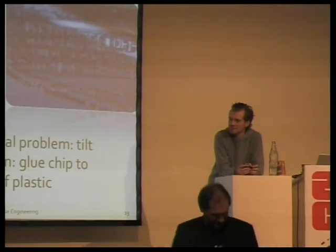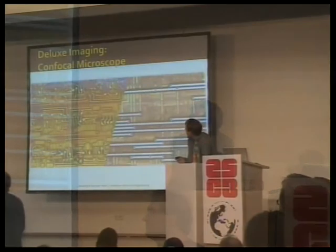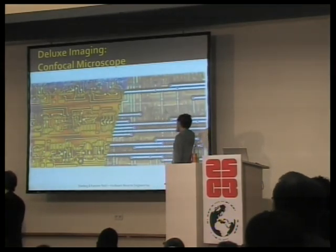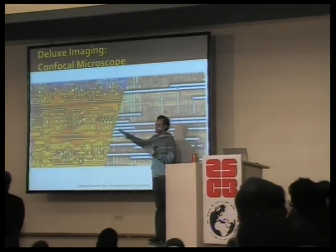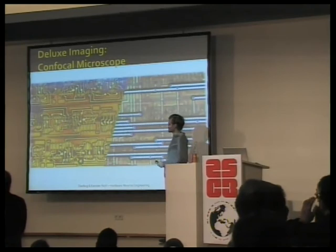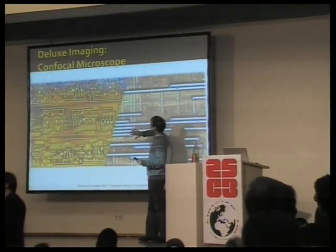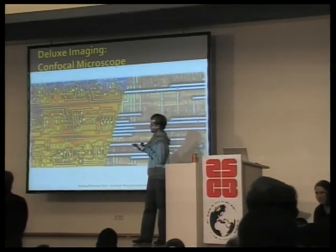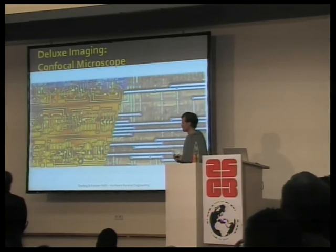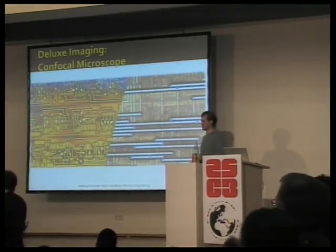Have you ever tried to reverse any non-planar technology, like MEMS? Yes, and in fact, this is a non-planar chip. Can't really tell in these images. They happen to be fairly nice, but planarizing a chip means that after you put a layer down, you basically file it so it's straight again, and then you put the next layer down and you file it again. Before they started doing that, the chips became a little wobbly on top of the lines. And if we file these down, we see that wherever there's a line below, we have to file harder, or something is left if we file with the same strength everywhere. So non-planarized chips are harder to work with, but they're also easier because they're old and everything is bigger and it's easier to take pictures of. But yeah, we can break both.